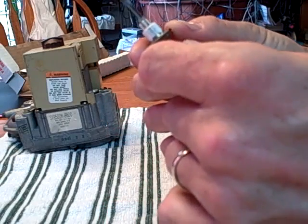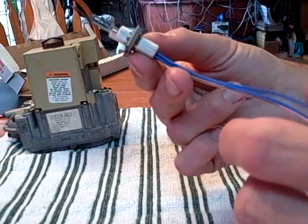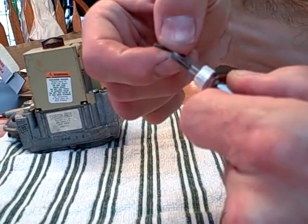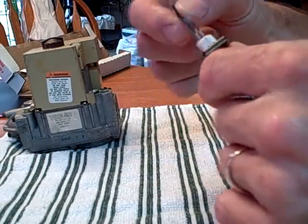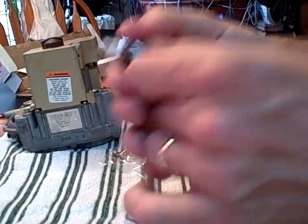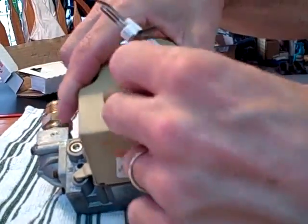The problem is it has a few issues I don't like. One is if the flame sensor gets dirty, it's a lot harder to get these out sometimes depending on where they're installed, and then you're trying to clean this flame sensor with some steel wool without cracking it. It's really easy to touch it and jack it up. They have little clips — this slides into a little slot with a clip that holds it into the assembly. And this just plugs into the top of the valve like so.